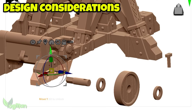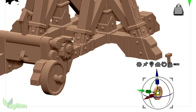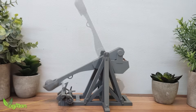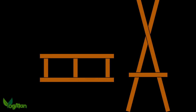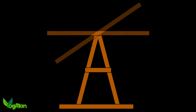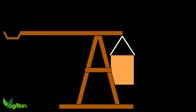I'm not going to do a blow-by-blow design overview unless that's something you actually want — if so, get in touch. Building a functional trebuchet at this scale took a bit of trial and error, but overall it's a very basic concept. Really it's just a collection of straight timbers, combining ladder and A-frame constructions into a solid little siege engine. The arm is simple and pivots at the top of the frame. There's a typical ratio of three or four times the length at the business end compared to the bucket end. It's critical the bucket hangs freely and needs to be big enough to store weight, giving the throwing arm energy.